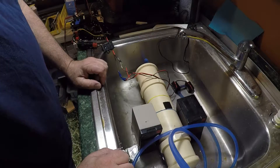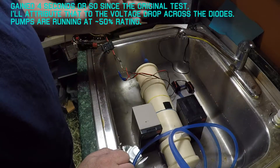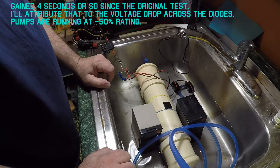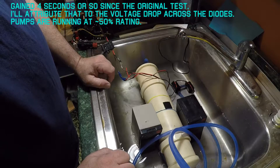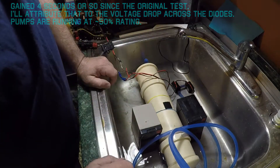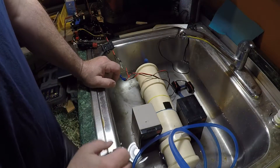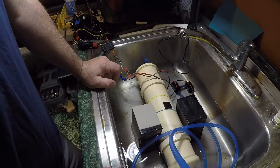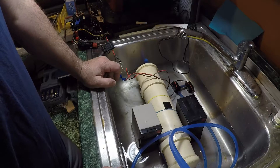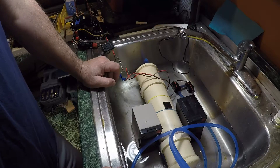The tank is on the surface. I'm very happy with it — about 54 seconds each way and drawing only about a quarter of an amp. In my larger boats I have room for this. Definitely a successful test. I'm going to take it apart, tighten up the wiring, and install it in the shark and give you a quick video. I hope this is informative for Ballast Tanks 101 — it's a very good system, especially if you have a large boat.